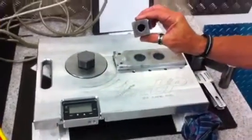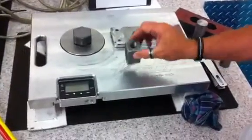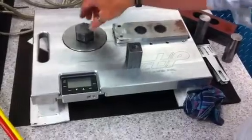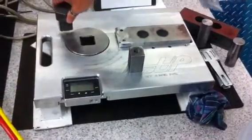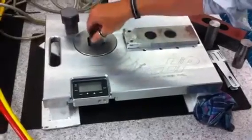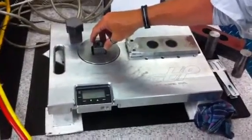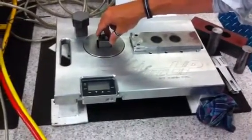This is a rundown fixture, so what we do is put a bolt in there with some cup washers, and as you run the bolt down, it'll actually stall out and give you a more dynamic reading, so we'll make one of those up for you as well. They just fit straight in there with a bolt — run your pneumatic tool down, your continuous cycle tool down, and that'll take care of the calibration.